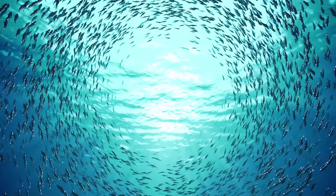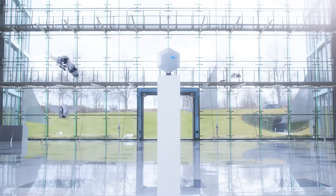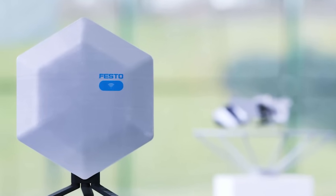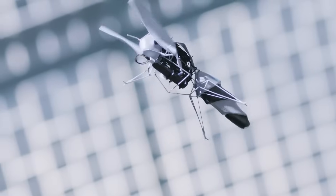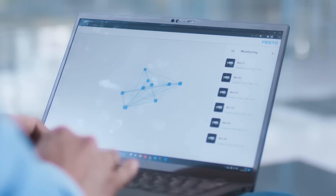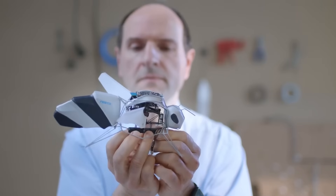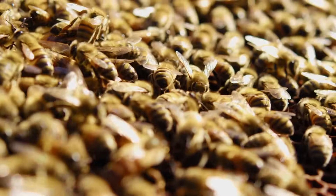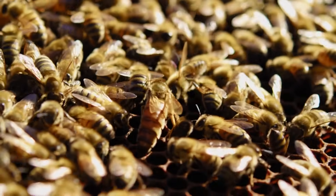Swarming may be instinctive in animals, but replicating that behavior in automation is no easy task. The Bionic Bee Swarm's autonomous behavior is enabled by an indoor locating system using ultra-wideband, or UWB, technology. Eight UWB anchors are installed on two levels for precise positioning. Every bee determines its position by gauging distances to the anchors and referencing timestamps. A central computer specifies flight paths for the swarm, requiring high spatial and temporal accuracy to ensure safety, collision-free flight, and account for air turbulence. Each handmade bee has an automatic calibration function to optimize its controller parameters, allowing the entire swarm to be controlled uniformly despite individual differences.